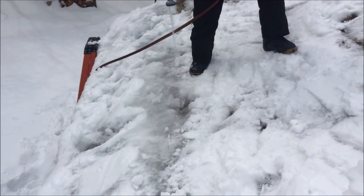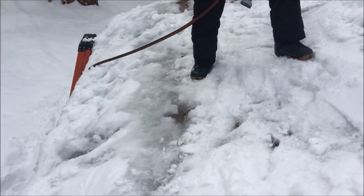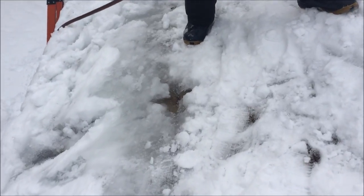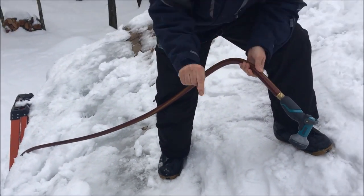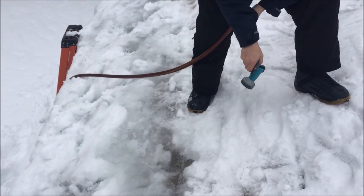When I do this with water, see how the water just sits there? A shingle is made for water to slide off and down. But when water sits like this on your roof, it goes under the shingle, down the nail hole, and right through into the house. So what you have to do is make a path.